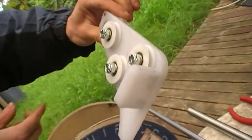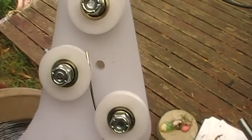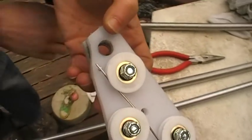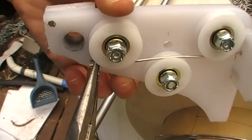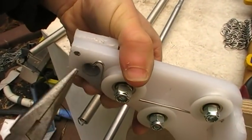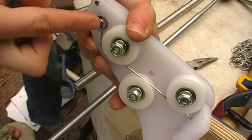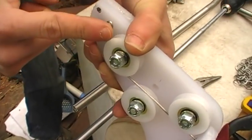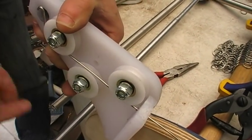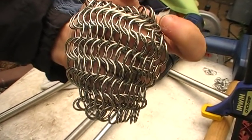What this jig does is the wire comes in through this side, goes through past the three guide rollers, and then I create a kink in the end. What this allows me to do is use a much longer bar, and these three guide rollers make the tension for the stainless steel wire. Note that this is 1.6mm stainless, which is purely an ornamental thickness, but with our chain mail we're doing a 1-in-6 pattern so it'll be a little bit stronger.